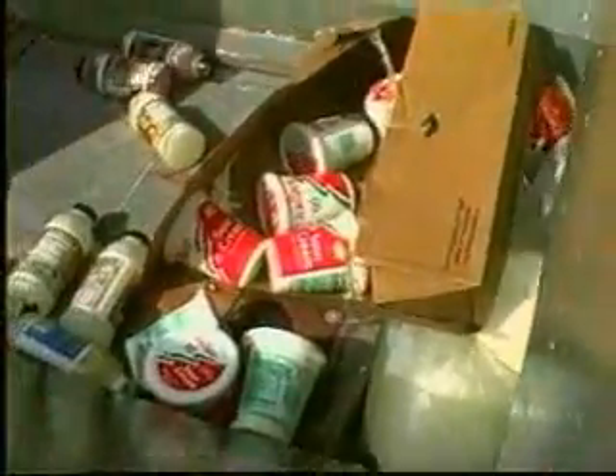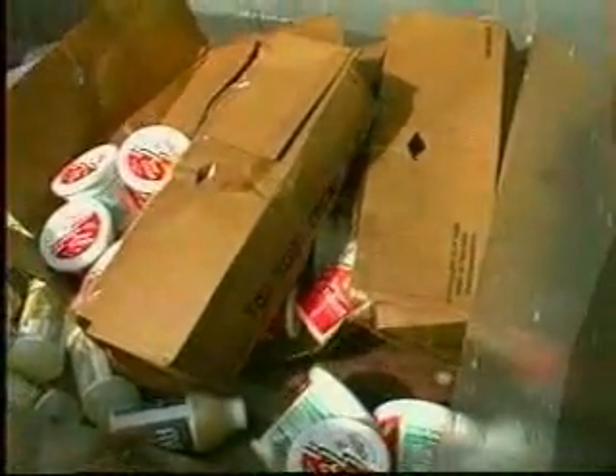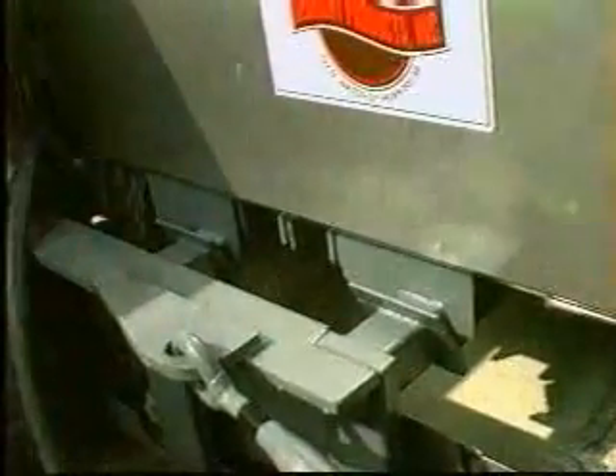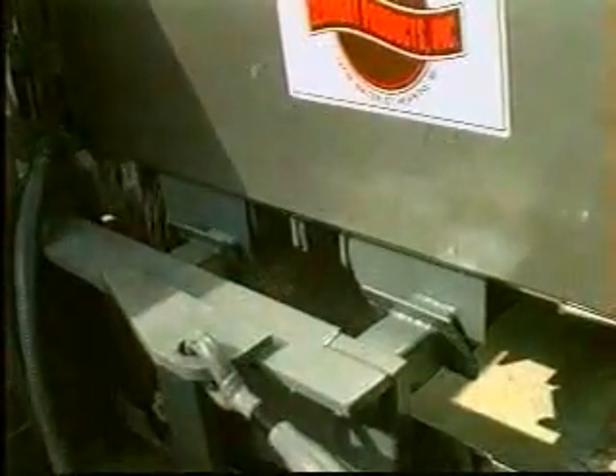After the material is loaded into the feed hopper, the extruder cycle can begin. Material drops to the floor of the charge chamber where the ram moves the material forward into the dewatering chamber. The stops that occur as the ram moves forward are programmed at the time of installation for optimum dewatering of the particular material. In the dewatering chamber, liquid is forced out of the packaging material through the apertures located in the walls, bottom, and top of the dewatering chamber.